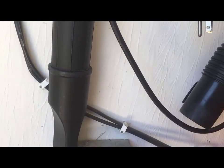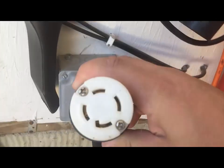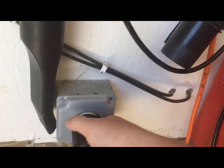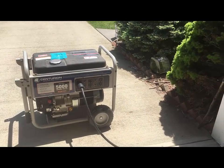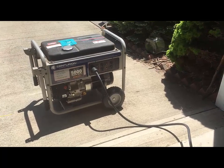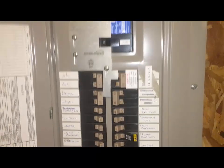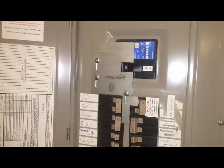We use a 30-amp power inlet cord — this is a two-phase 220-volt setup. It plugs in here, and we have a special inlet socket made on the house side. It's keyed so you can only go in the right way. Once it's hooked up and the generator is running, the one final thing we have to do is switch over from the main. I'm going to go to the basement now where our power panel is and show you how it's done.